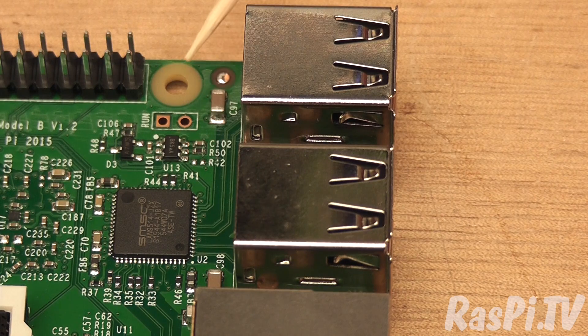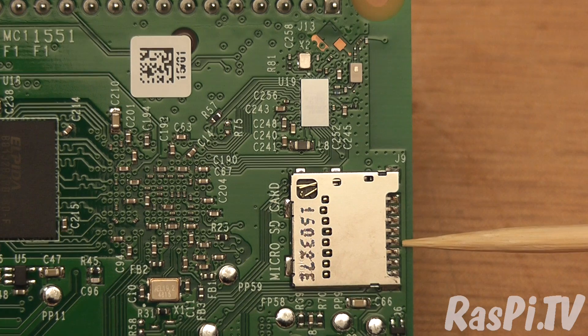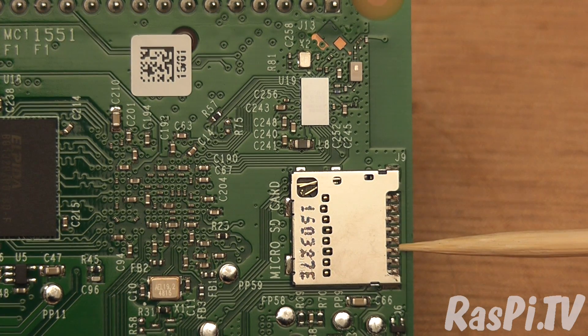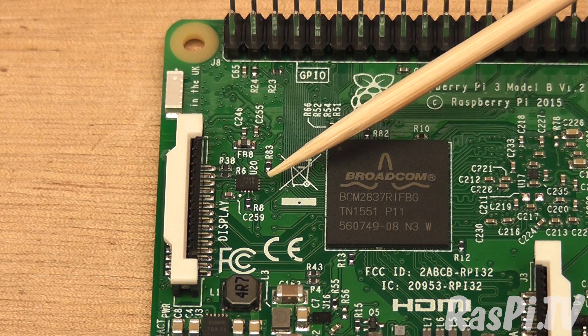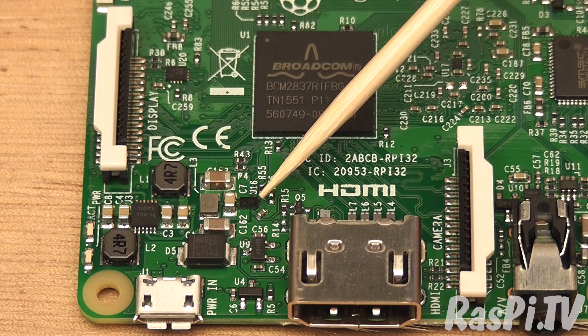The run header for resetting the Pi has also been repositioned near the USB ports. The micro SD card slot is no longer click-in-click-out — it's now a friction fit, like the Pi Zero. This should avoid accidentally popping out the SD card. There's a new GPIO expander chip at U20; I'm not quite sure what this is for yet, but it is suspiciously close to the DSI port. U16 is now covered with a black shield, so we shouldn't see any more of the Xenon death flash resetting your Pi when you take flash photographs of it.